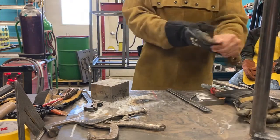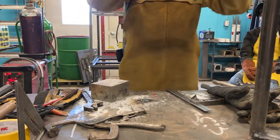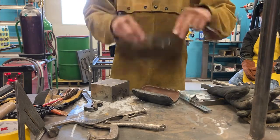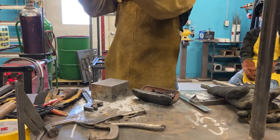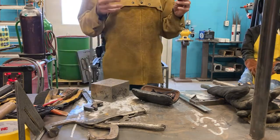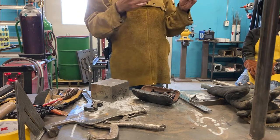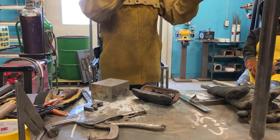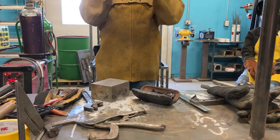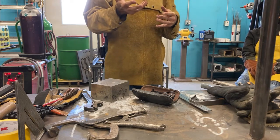So now the next thing is I'm using a 7018 rod. That's what we're going to use to weld it out. I'm actually going to switch glasses. These are bifocals. These are the cheapo readers I've been telling people about. If you do wear glasses, bifocals, unfortunately, are great for driving because I can see here and in the distance. Bad for welding because you're at a fixed distance. So fixed readers are fantastic for doing small work and welding. So you may want to look into it.